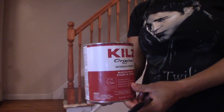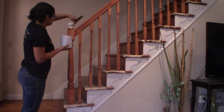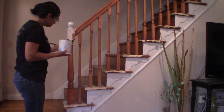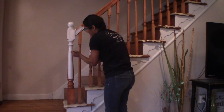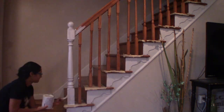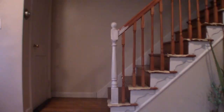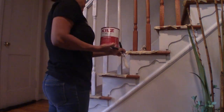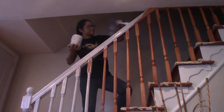Now it's time to prime. Here's my primer — this one is an oil-based primer. I apply it in thin coats to avoid any drips or messes, and it goes on pretty easy. It helps the paint stick very well. Sanding and painting each individual banister was a lot more work than I anticipated, and I had to make sure that I didn't miss any spots — and there were a lot of them.